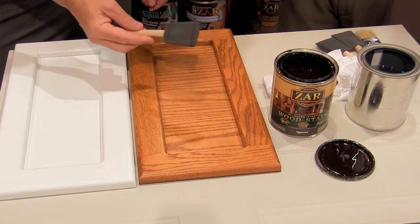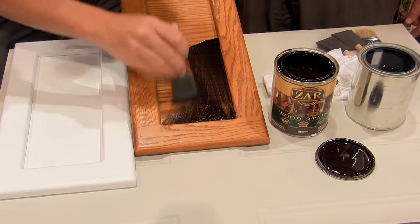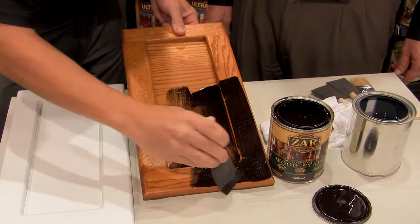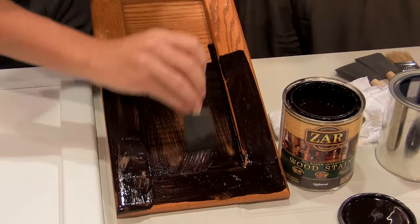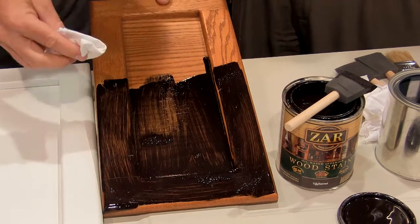I like to use these foam brushes. We're going to use a black color stain and just wipe it all into the surface. You're just really loading it up there. Just get it all through the surface — it doesn't matter how you apply it, just get it on. Do you need to get it on every single surface? Well, it depends what you want to do. If you just want to put it in the panel and wipe off the excess, but here I'm really toning and glazing the whole door panel, so I like to cover the whole surface. Then once you cover the whole surface, you're going to get a dry rag and wipe off the excess.